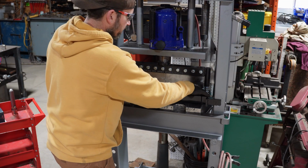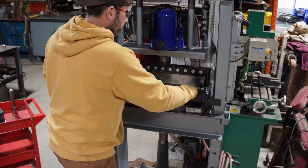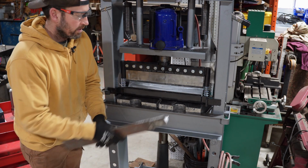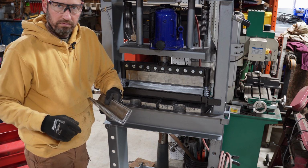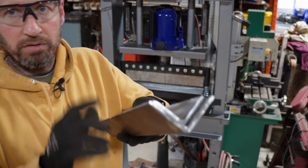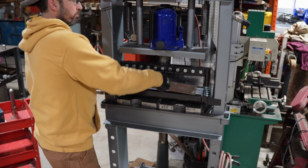And then with the finger brake itself, it comes with a piece of 3-inch angle that you weld in here, okay? Then to get a tighter bend radius, you can add in stacks of angle iron. So they recommend a 2.5 and then a 2-inch, and I'll probably even go down to 1.5 inches to put inside of this,